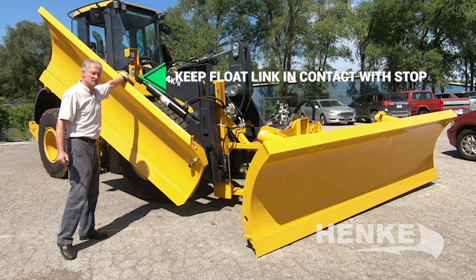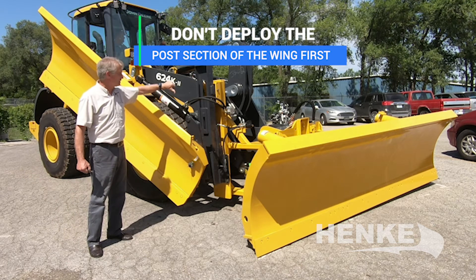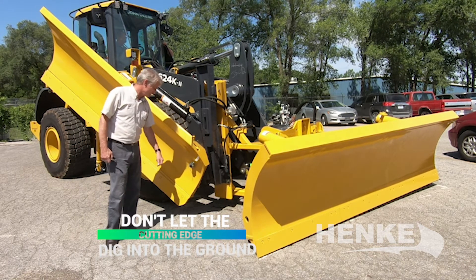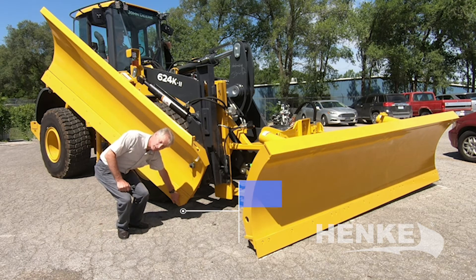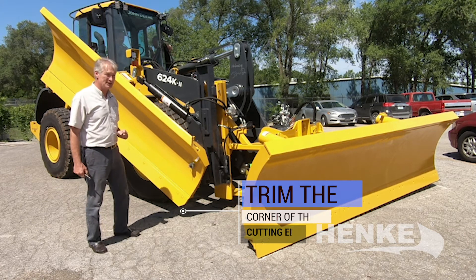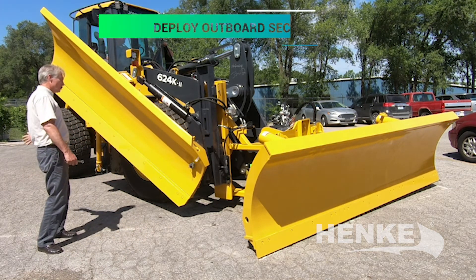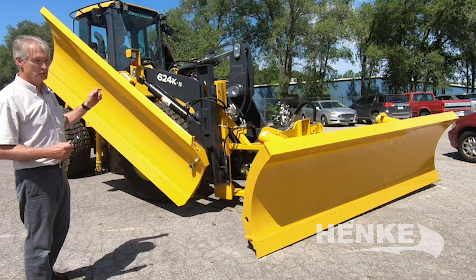Allow the float link to be in contact with this forward stop at all times. Deploy the outboard portion first, because if you let the slide down first, you'll have a tendency for this cutting edge point to dig into the pavement — and when that happens, the force of the road hitting the cutting edge will cause the wing to kick up violently. To help alleviate that, we always trim and chamfer the corner of the cutting edge, cutting it at a diagonal so it won't catch or dig into the road. Whenever you replace cutting edges on your wing, always trim this leading corner. Properly done, the outboard portion comes down first, then the toe or slide portion comes down, preventing the leading edge from digging in, tearing up concrete, or causing the wing to flip up.